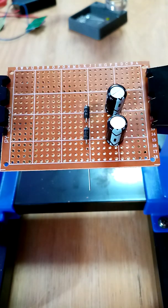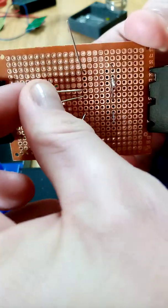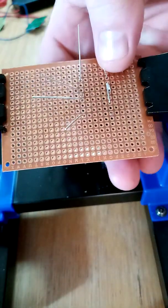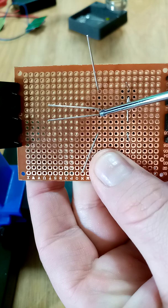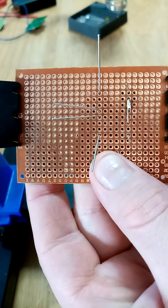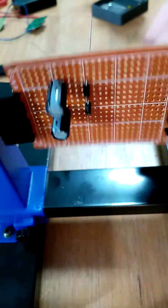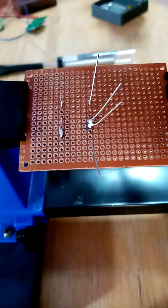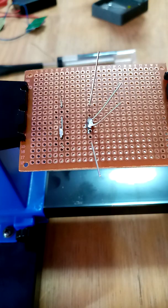Now we want to turn it upside down. These are the diodes there — you want to solder these two together. When you've done that you should have something like that. It's not very professional but it's a bit difficult working around the camera — all the excuses under the planet, I know.